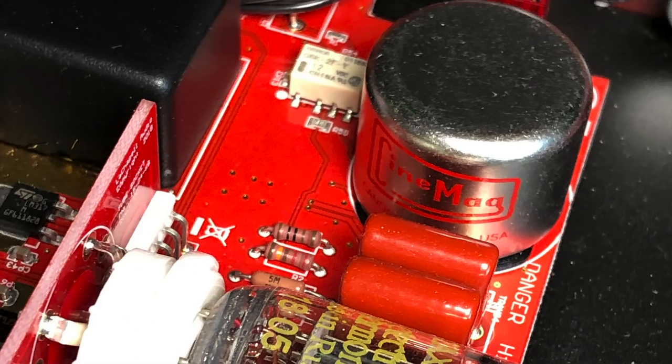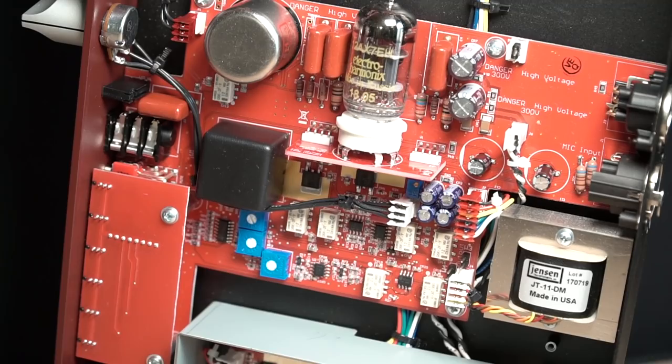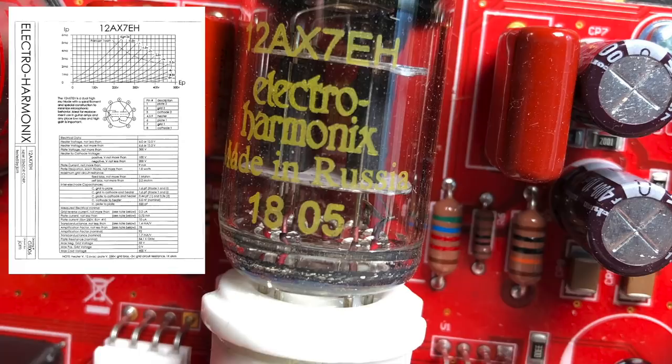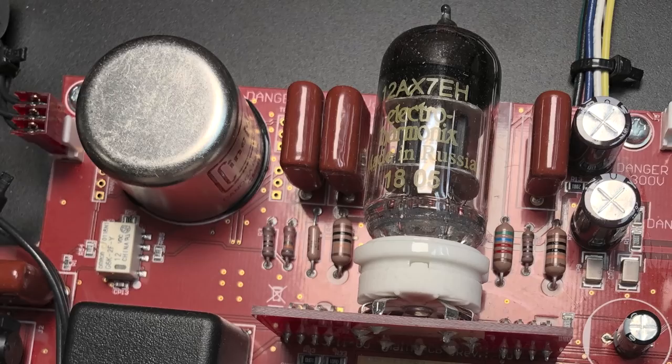After that, they're using a modern 12AX7 EH tube. These are a modern updated design specifically engineered for audio applications with reduced microphonic properties. You'll often hear folks claiming a lot of benefits from using vintage tubes, but most engineers who know what they're talking about will tell you that the modern equivalents are built to far better tolerances and will serve you better in professional applications for sure. I'll link below to Mr. Carlson's lab and a few videos he's done talking about that in much greater detail.